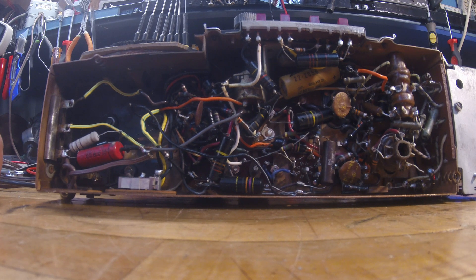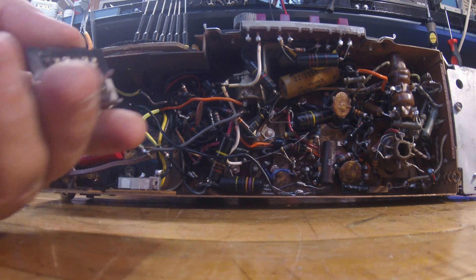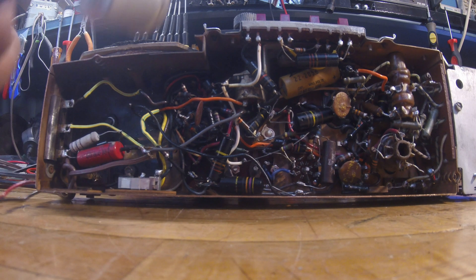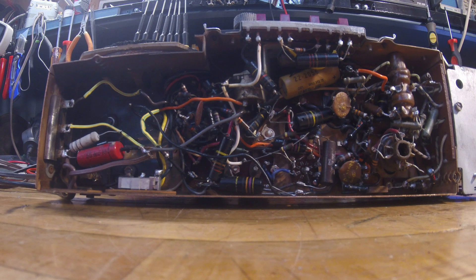But I think now, fingers crossed, I've got her back. I've omitted the DC switch that was built in there, took out the DC battery pigtail that was in there, and I've rebuilt the circuit using some modern diodes, resistors, and caps — re-engineered the circuit to where I believe I'm good. I've just got through checking the plate loads, and it looks like the current draw is right on it.